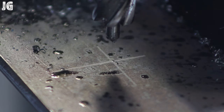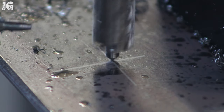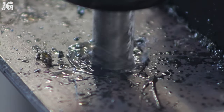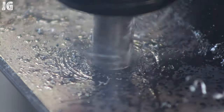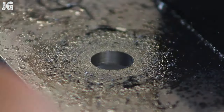Here are a couple of close-up angles of the drill showing what I was talking about — how you line it up over top of a mark on a plate. The centering pin in the middle of the annular drill lets you line it up over center, engage the magnet, and start drilling. You can see how smooth and effortlessly this thing drills through. Pretty cool.